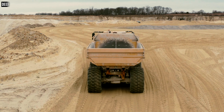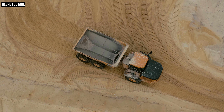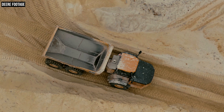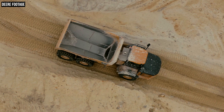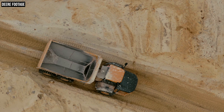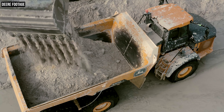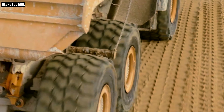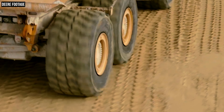Back to that dump body — the first change Deere has made is that they've made it wider. With these new trucks, you get three benefits from that wider dump body. First, the truck's center of gravity is lowered, giving you a more stable feel while driving. Second, the wider body puts the bin closer to other machines for easier loading. And third, it provides tire coverage, almost like a big fender, keeping material from going into the tires and wheels, and keeping material that may sling off the tires from going anywhere but right into the bin itself.